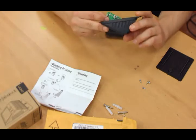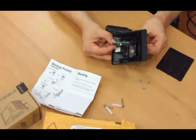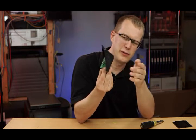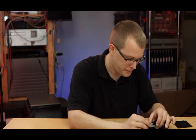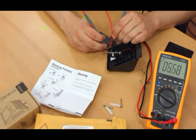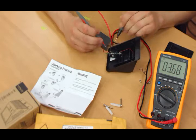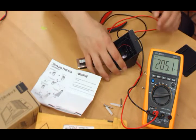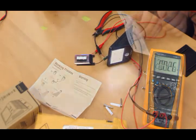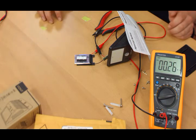I think I won't take those off until after I've tested this outdoors, because I don't want to risk ruining any water tightness it might have. As I suspected, if I put this key thing in where the power switch is, it just passes right through — there's no waterproofing at all there. That part would be facing at a downward angle when attached to a wall, so I assume not much water would get in, but if this gets hit by a driving rain, water would almost certainly get in that tiny hole and fall right onto the circuit board. I did a quick test of the battery voltage, which is at 3.68 volts. Assuming this is a lithium polymer cell, a full charge should be 4.2 volts, and it'll be empty at around 3 volts, so it's just about its nominal voltage of 3.7 right now.